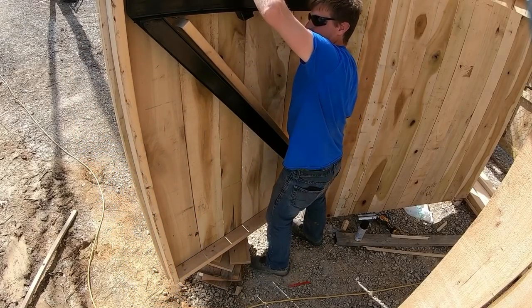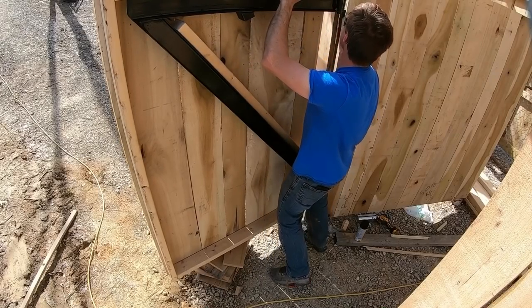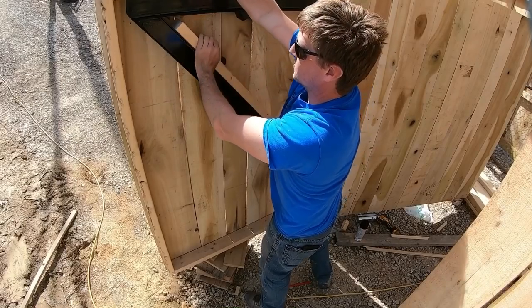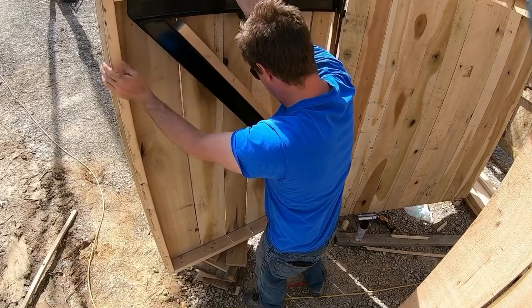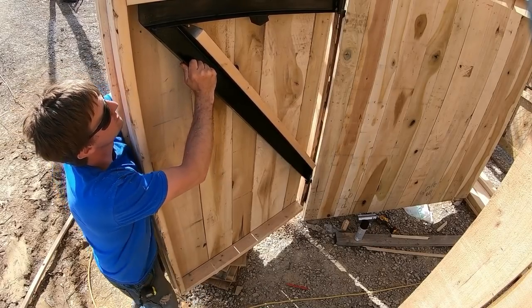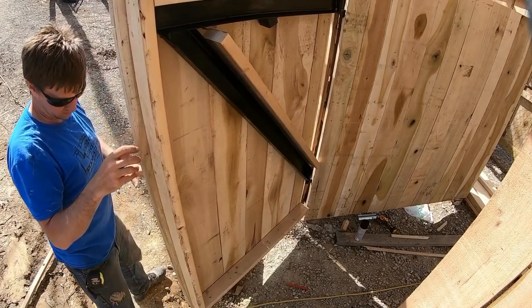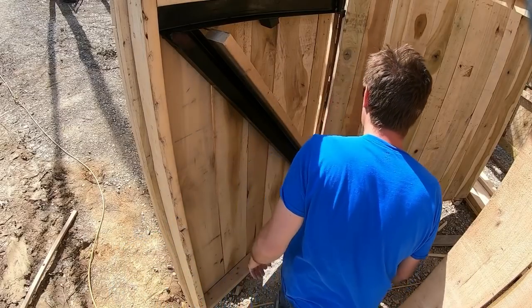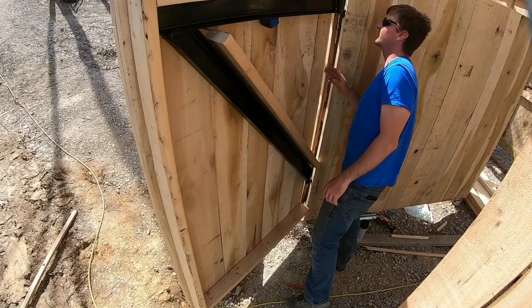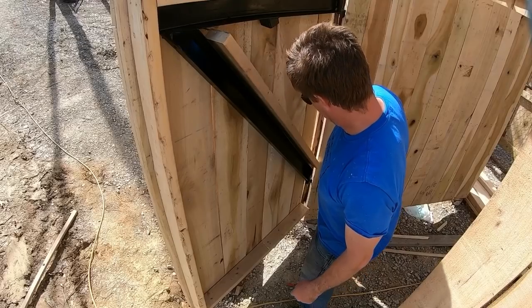The brace I think people were talking about is actually the diagonal brace on the front that I put on that is poplar. Now from this side, you can see that bottom right corner, if you're going into the barn looking at it, is kind of flopping around down in no man's land. So to help combat that thing warping out or that thing coming apart or just help keep it from flopping around in no man's land, I threw a wood diagonal brace across the front to tie it all together.